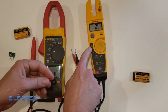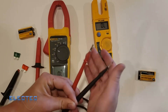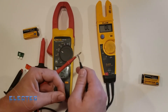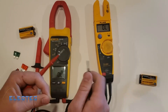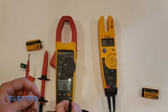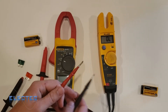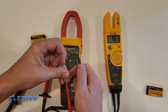Let me demonstrate this quickly on the T5600 — same thing, it has ohms and continuity. One thing about that little voltage the meter puts out on the ohm setting: it's low enough you're never going to get shocked from it. You can see it beeping and showing about 2 ohms resistance when the leads touch. The amount of current the meter pumps out for ohms is never enough to hurt a person or animal — you just don't want to put it near another power source.